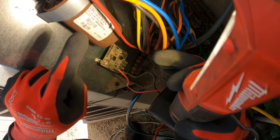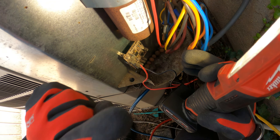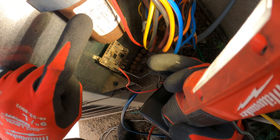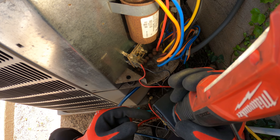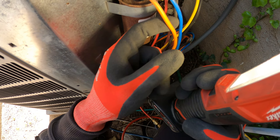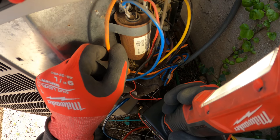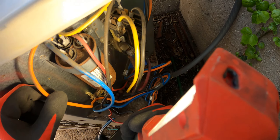What we want to do is look at the ratings. This is a dual capacitor for both the fan and the compressor, and we see it says 40 plus 5 UF — microfarads. That tells me we need 40 microfarads to start the compressor and 5 microfarads to start the fan. We're going to pull the wires out, take a picture or write it down so we can put everything back correctly, and test to see what ratings we have. Everything is color coded.